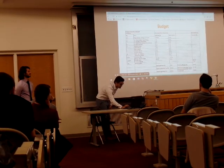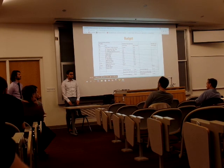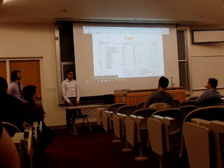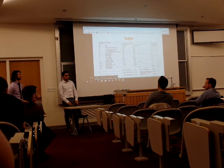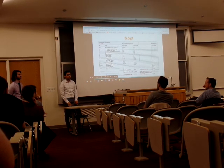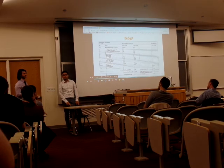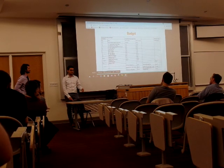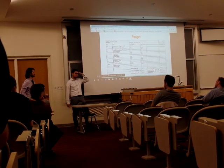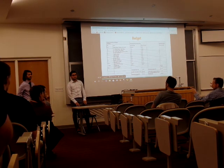The test condition is applying 11 Newtons to the head. The original idea was to use an optical tracker to observe the deviation. We've done preliminary tests, and for more detailed measurement we'll observe how much displacement occurs. We are going to do measurements under the microscope as well, with the optical tracker serving as an intermediate test. The optical tracker has resolution on the order of 0.35 millimeters.